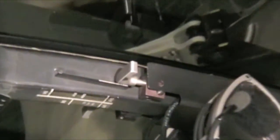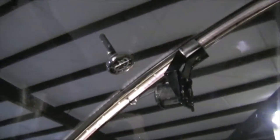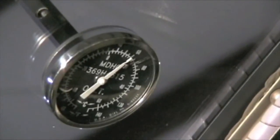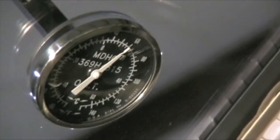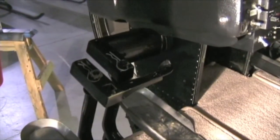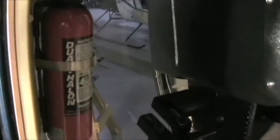Here is your cabin heat and your engine anti-ice on the right side — that's your bleed air system. Check your outside air temperature gauge, take note, make sure that's working properly. Different than the Robinsons, you can actually see it's specific to the MD Helicopter 369. Got the compass right next to it. Coming down, make sure nothing would prevent the controls from going full travel. Make sure the pins are installed on the pilot's torque pedals, and the fire extinguisher is installed.